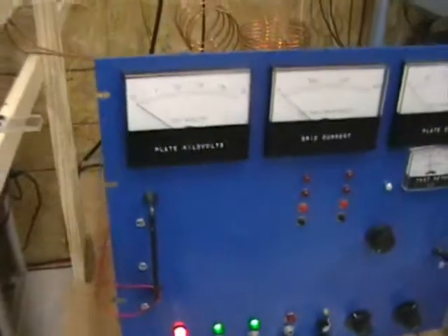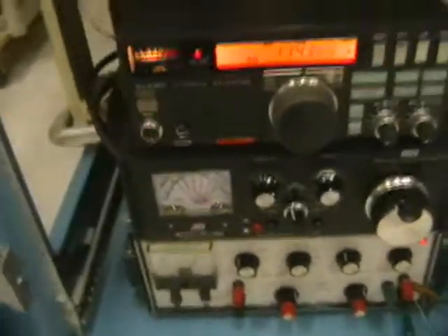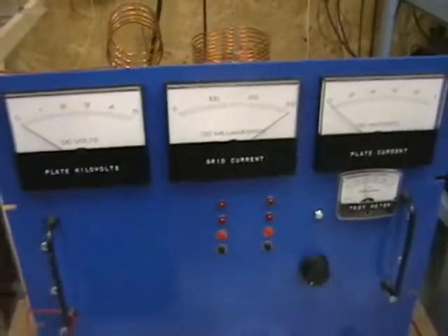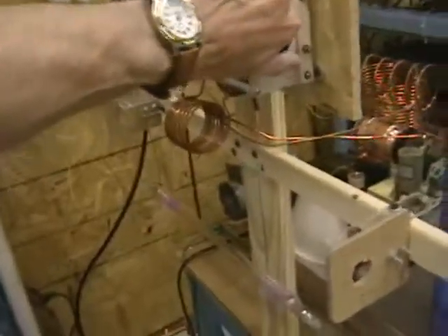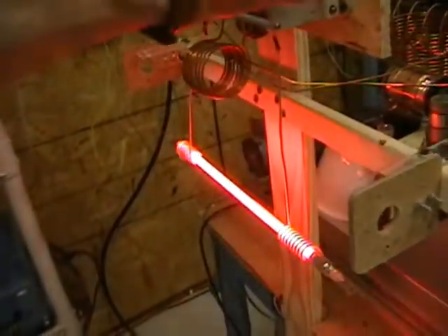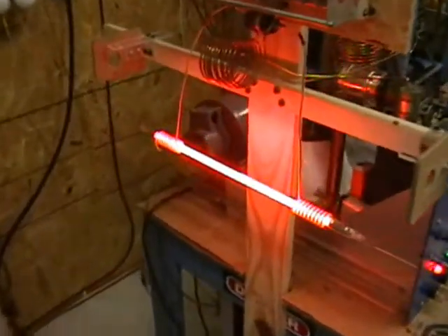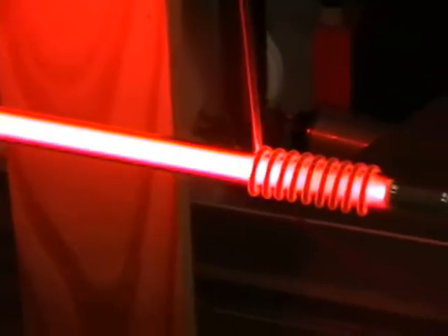Filament power is on and everything is running normally. To tune it properly, we take the tuning capacitor and adjust it for minimum capacitance, which throws the circuit off resonance. Then we turn on the FT-747 by grounding the key wire — the 747 is now putting out power. We tune for lowest SWR and maximum power into the system. We then go to the secondary tuning knob on the capacitor and adjust it until the tube lights, tuning for maximum brightness. At this point, approximately 70 watts of the 100 watts coming out of the 747 is being fed directly through the amplifier into the tube, which is sufficient to light the tube.